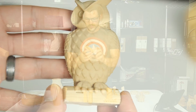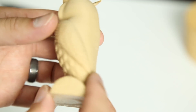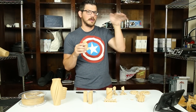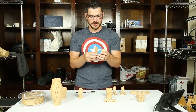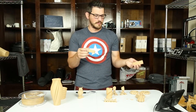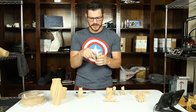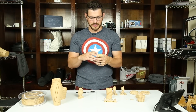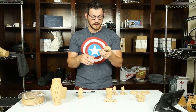I did the Owl just because, why not? He's got his feathers on his chest here, and you can really see how well a filament will cool and how much it droops down at the very tips of those feathers. This did droop a little bit at the bottom, but it got much better at the top as the chest rounds over to an easier angle. Then I found these last-minute — also horrible models. I tried printing all three of them in a row on the i3 mini and it did not go well. They had way too thin of walls and were just bad models. I might try to repair them and see if I can do a better job with either this wood filament printing them one at a time, or with a different wood filament that I have coming in.